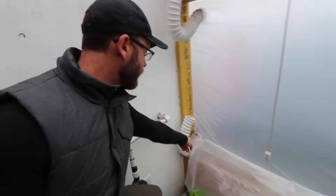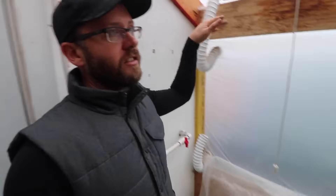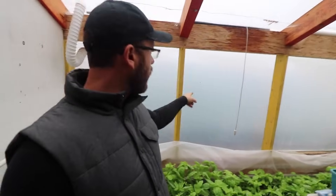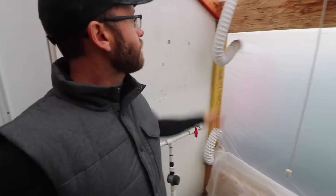I've also put little holes here and there in the plastic just to drain it out, and we've also got an exhaust where I've just cut into one of the layers of poly so it's blowing out. On this greenhouse I also had to bridge one poly section to the next, because there's essentially a fold in the poly at this post. I've done that by cutting in a pipe — just the kind of piping you'd use for a laundry dryer — in two places. Any time you have a seam or crease in your poly or separate channel lock sections, you have to bridge them together with a pipe like that. Even if there are small leaks, it doesn't matter because the air is constantly blowing.